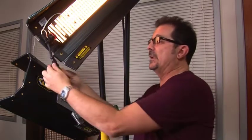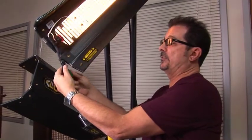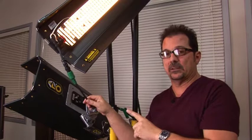With current technology we've been able to rectify that. Now if there's a disconnect, it actually turns on and off instantly — there's no delay. The ballast is still electronically protected and still latches up, but with micro-technology it happens in just a flash, so you don't realize the ballast is restarting — it's instantaneous.